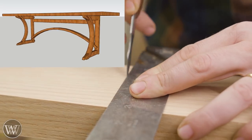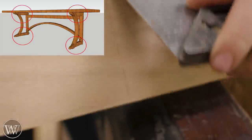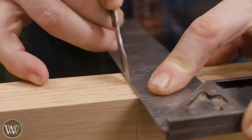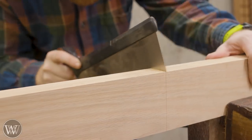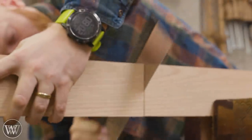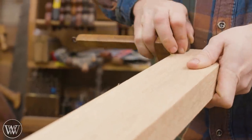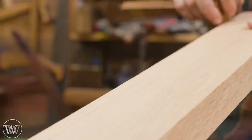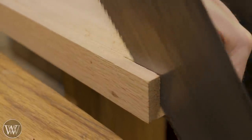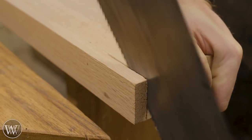Let's work on the base structure. We're going to be working on all of the straight pieces and what I want to do is cut them to length and then cut them to width. All of the rough stock I'm using is actually inch and a half by three and a half inches and I want to take it down to inch and a half by three inches. I like that dimension — it looks a little bit better than the beefier three and a half inch wide. So I'm going to cut most of them to length and then rip them down. As opposed to ripping long eight to ten foot boards, I find it easier to rip smaller segments — it gives me a chance to take a break and relax. Most of these are around two foot long.